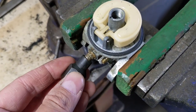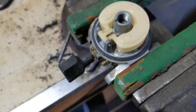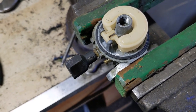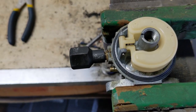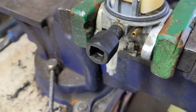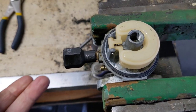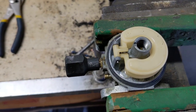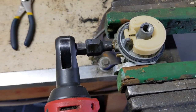What we're going to be using is the quarter-inch extractor because this thing fits over these brass inserts very easily. Look at this. So what we're going to do is just push that on snug and we're going to give it a light tap with the hammer to seat it into the brass insert. You don't need to hit this hard — we're just looking to seat that onto that brass insert. These extractors have a 3/8-inch ratchet adapter and you can use a ratchet to break that loose.